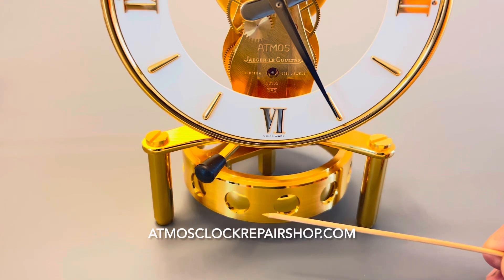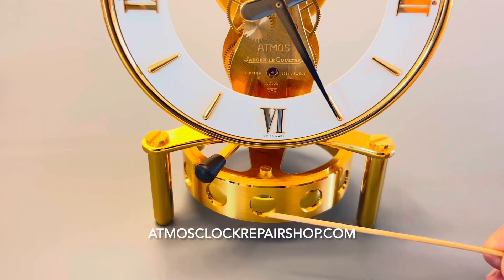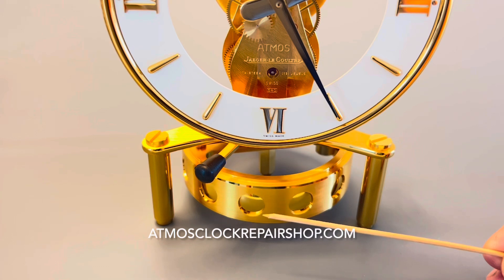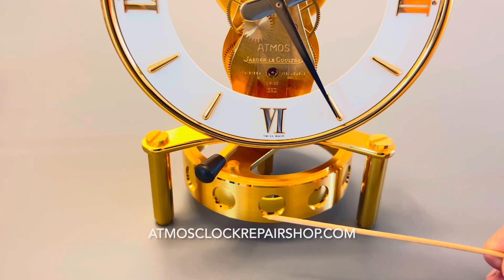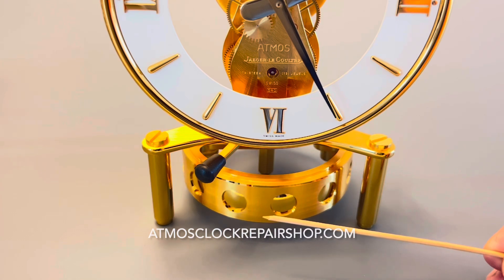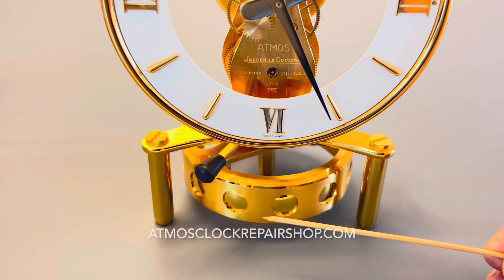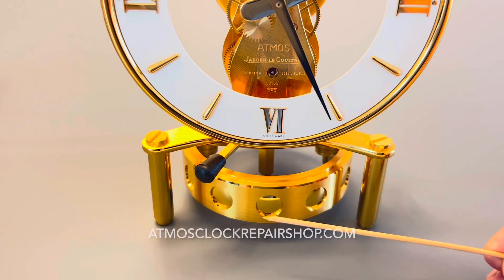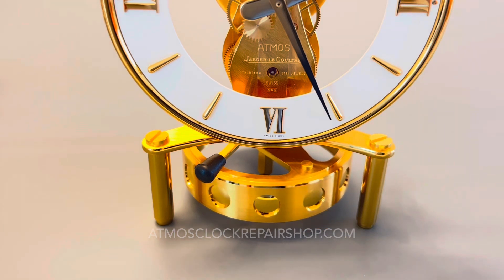So this is called being in beat. Clocks that are in beat and have amplitude tend to keep very good time when they are regulated. The regulation process happens on the top of the clock at a lever — that's very easy to do, and everyone can regulate their own clock. As you can see, we are exactly 17 motifs in both directions, so this is a clock that should keep very accurate time for probably the next 15 to 20 years until it needs another overhaul.